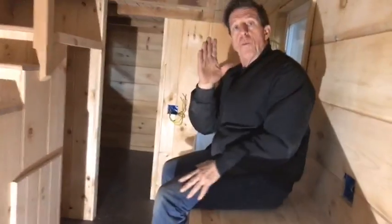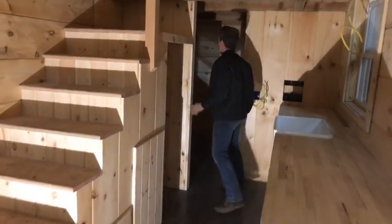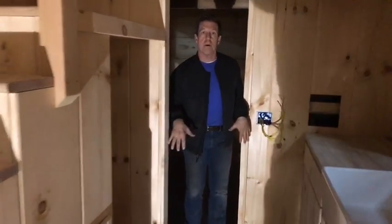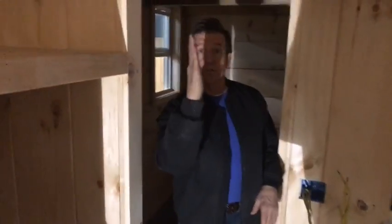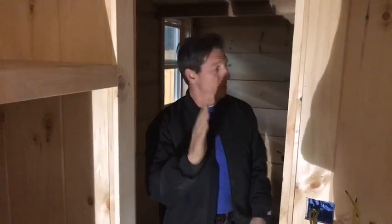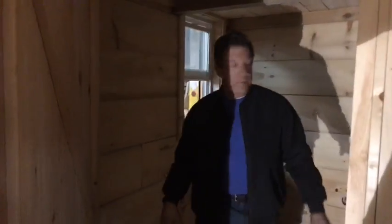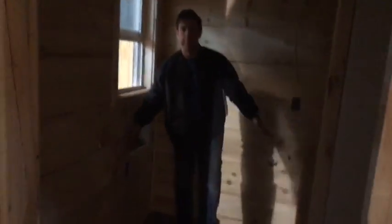I never put more than one interior wall in the whole house. And it's always in the bathroom, right here. That's the only interior wall. And when we do an interior wall, it's 3/4 inch wood. It's not a 2x4 thick wall. It's 3/4 of an inch. And we lay out our plumbing and light switches to figure that. And we've already showed this home, but it's a big bathroom, okay?